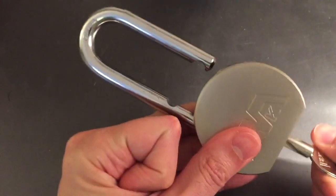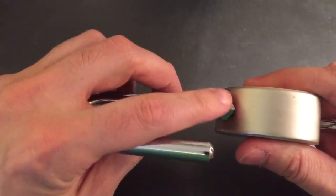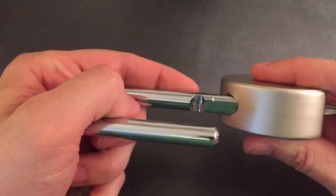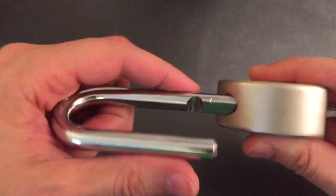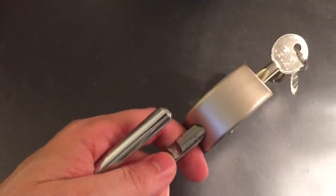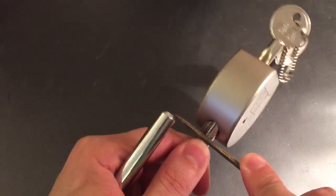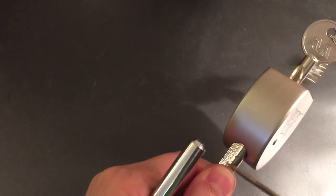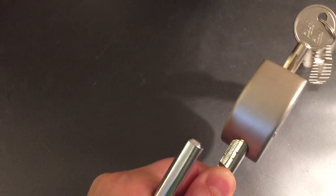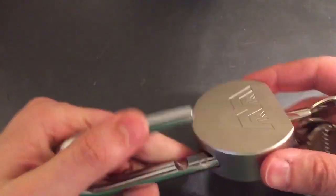I was a little bit disappointed. I did a little testing when I first got this — I usually test the shackle on an unknown lock by putting a file against it and doing a couple swipes. You can see the file cut really deep into the shackle in these two spots. Let me get a file out now and show you. That was just five swipes, and I cut pretty deep into it. So it's not hardened to the extent I'd like to see.